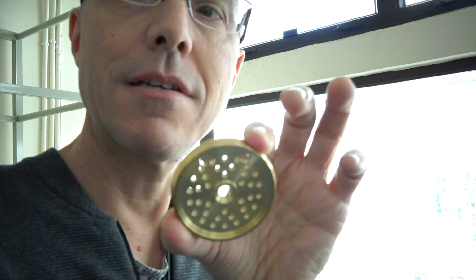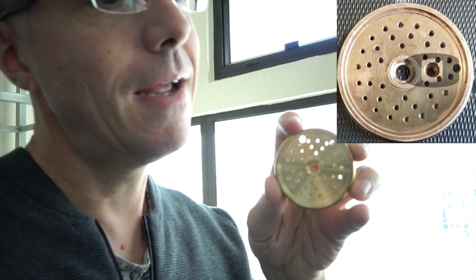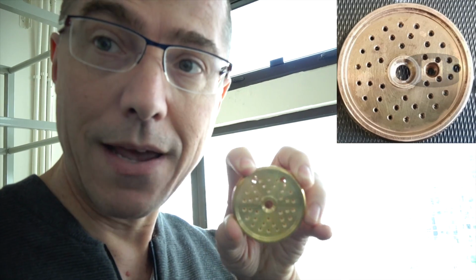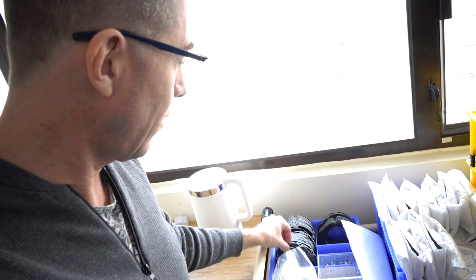The other hole is for the temperature probe that goes all the way through the entire group head and rests right behind the shower head about 2 millimeters away from the coffee grounds themselves. That way we're able to sense the temperature of the mix of coffee and water and adjust the water temperature accordingly. This stack of black PCBs is also new to version 1.1.